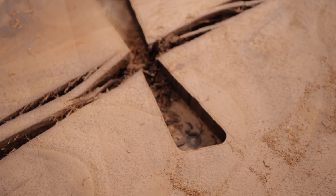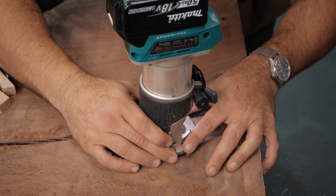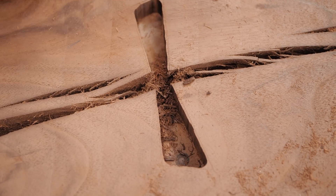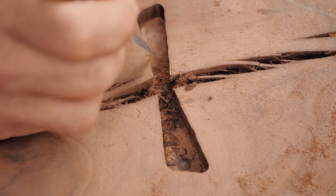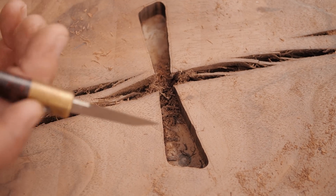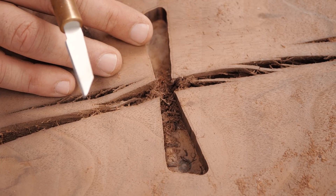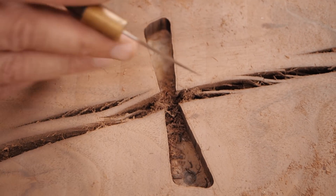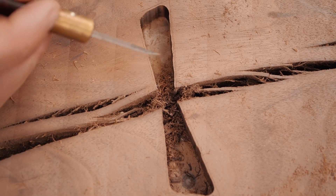Here's why this technique is so good: take little bites and get a majority of the waste cleaned out. When you use that grip, you can just guide it with your fingers. Palm routers are great for this. The great thing about spiral bits is you can sort of just ride that edge — if you try to push too hard, it creates stress on the bit and router, and can even bend the bit. You want to get so close because these are cut at 90 degrees, and with a chisel you can go the wrong way by a few degrees, giving you a wedged butterfly key. With glue, that becomes a real problem. So get really close — one hit with the chisel will clean up that edge and keep it square.